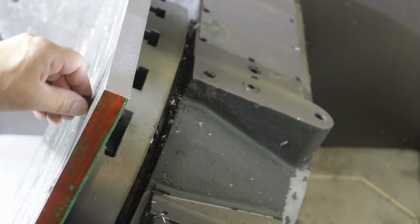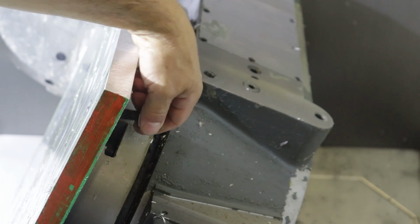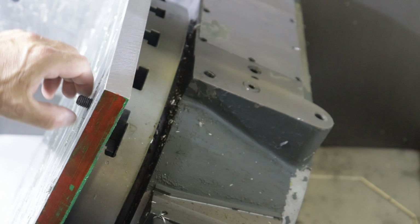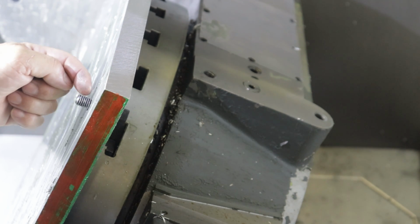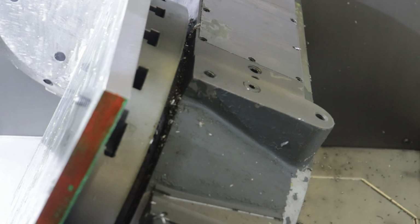Yeah, this bolt right here can come out. I made a kind of tight tolerance just to keep things under control for repeatability. And basically 1.5 diameters of half 13 bolt is what held the big mold plate in place. And there were 4 of these, 1 in each corner.